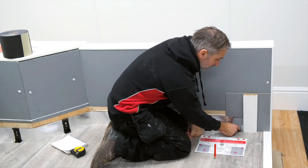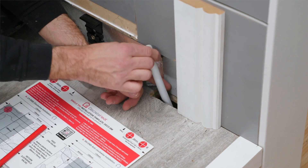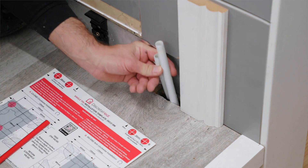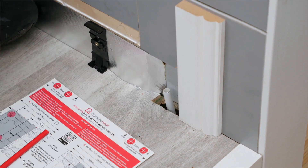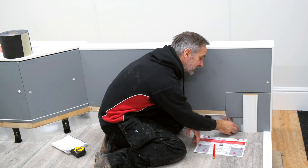As you can see, I'm using 15mm plastic pipe which we do recommend. I've also left it flexible so we can move it up and down and give ourselves as much room as possible. You can also do this in copper, but as you can appreciate you won't get as much flexibility with the copper.